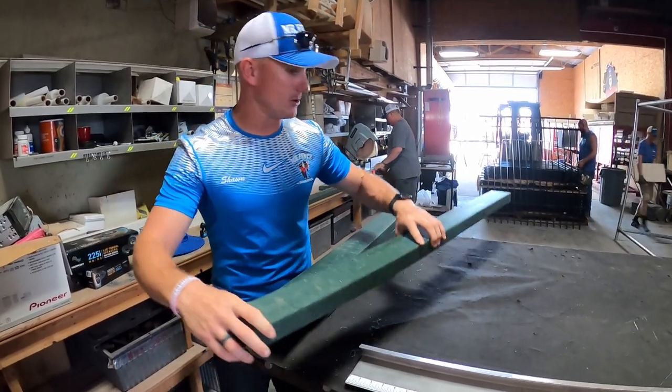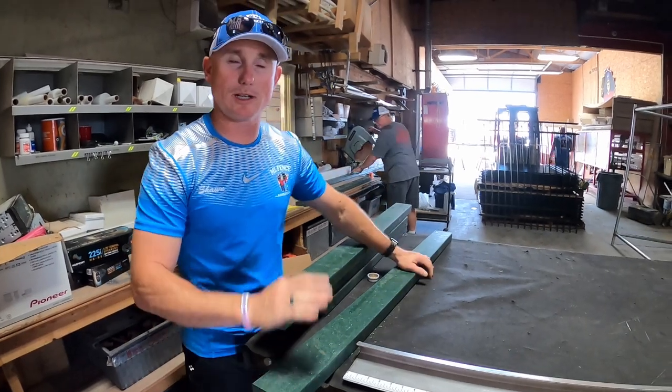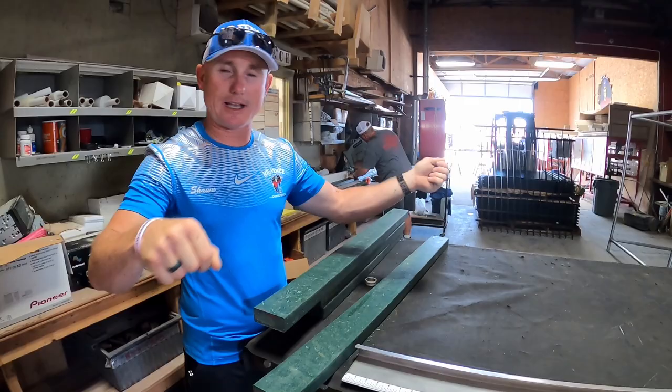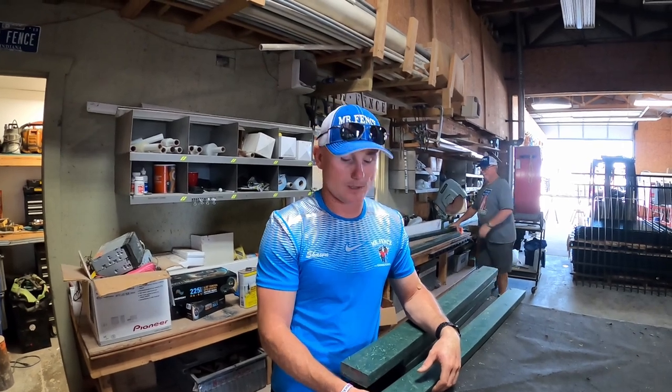So when they go to set their gate post, they lay it on the ground for the first post that's set, and they level the next post to it. We want to get away from tape measures. When they're trying to hold the tape measure to measure that gate opening, it's very inaccurate. You're off a quarter inch, half inch to a pre-made gate, the homeowners will start to complain about the gap. So we've got to keep it quick and efficient and easy.